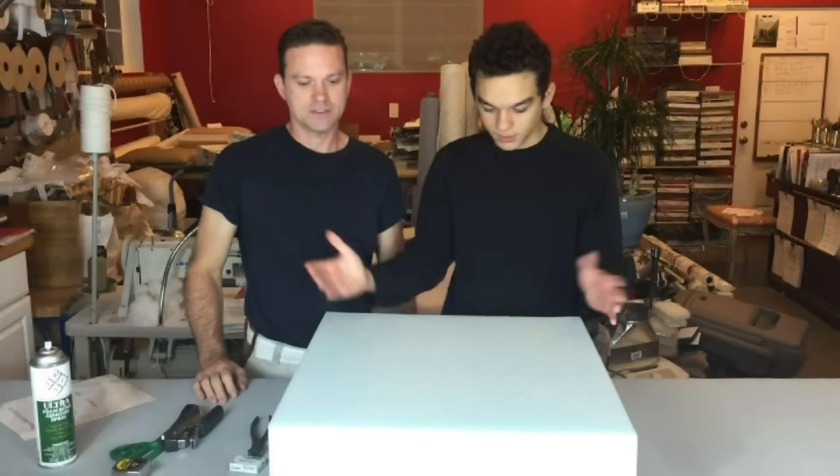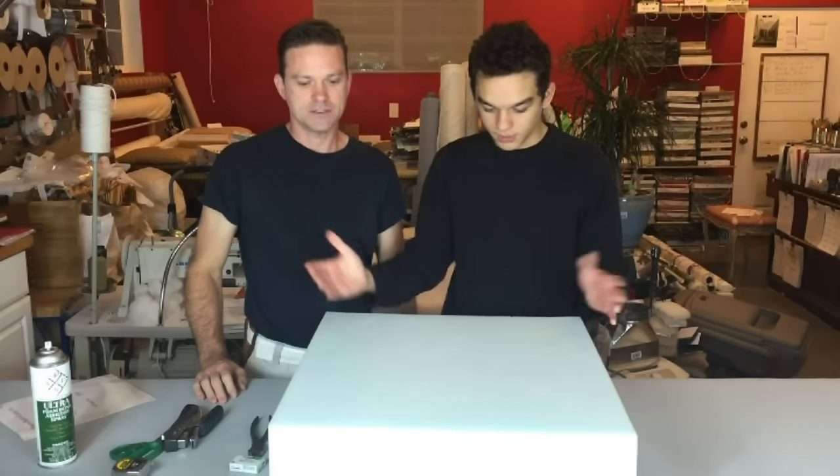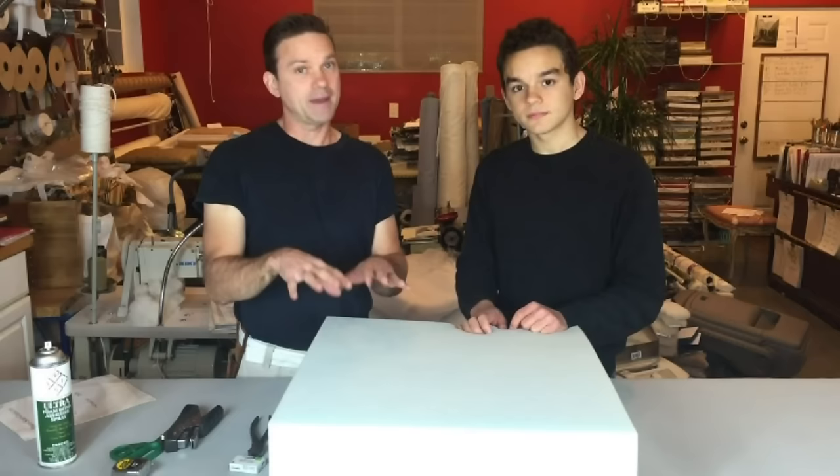We're back and the foam looks great — it's definitely decompressed. It's important to know what to order. This is a 26 density foam. The higher the number the better — if you can get higher than 26 that's great, because the density of foam indicates how durable it is and how long it's going to last. The standard is about 18, which is your average foam in a furniture store. 26 is better and will have a longer life to it.